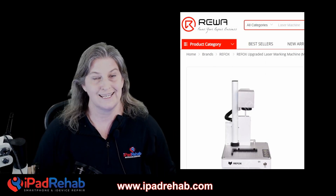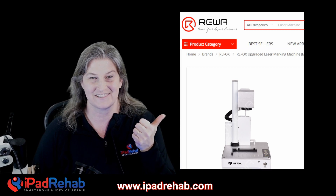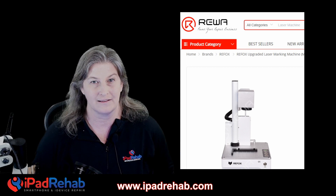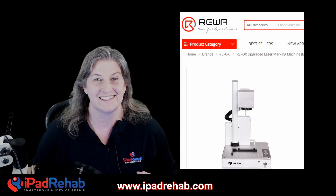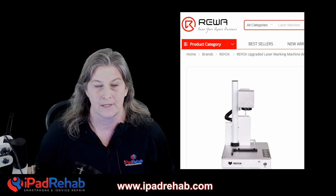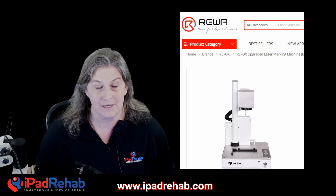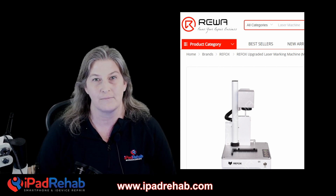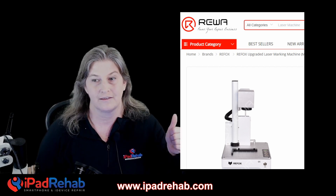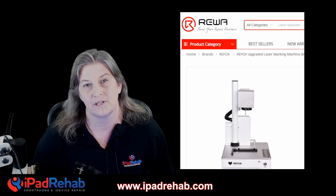We're going to talk about laser damage. Everybody's got these back glass laser machines to laser off cracked back glass. As long as you take the logic board out before you do that repair, you're not going to have any problems — it's a great repair. But if you don't, you can get into lasering the motherboard itself, and that's going to cause problems, especially with camera and flash. I've got a case right here where the laser did exactly that and chewed up the board a little bit.